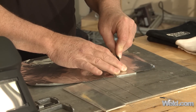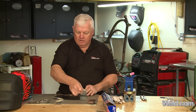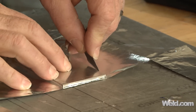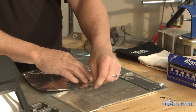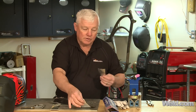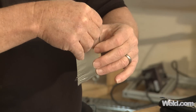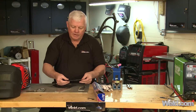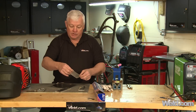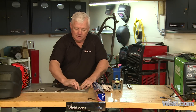I'm using my X-Acto knife here just to cut this material, which certainly doesn't take much at all. Now this is 1100 series aluminum, so I'm actually going to use this little TIG machine, which is a DC-only TIG machine. And I'm going to set it to make sure I don't exceed about three amps. I have two pieces that are cut and I put them in somewhat of a sandwich — it's just two-ply — line up the edges, because the edges are actually what I'm going to use for filler material. I just put it on this plate right here and utilize the plate as my alignment.